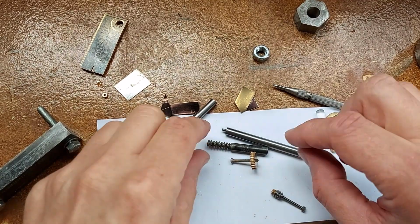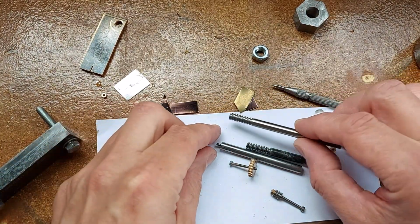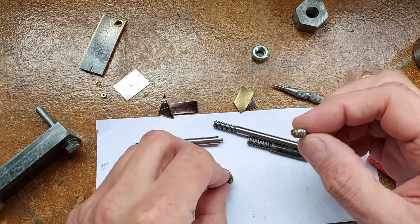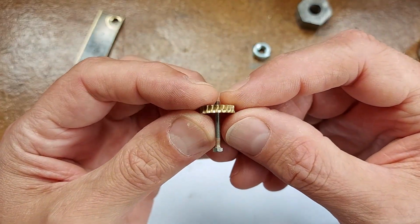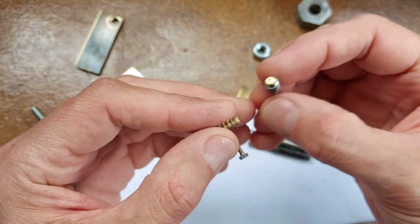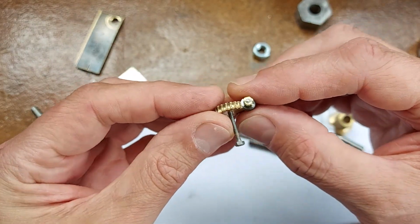So now, after making the hobbing tool, hardening the hobbing tool, some practice parts, making a mandrel to hold the gear, I've finally made the gear, and then as you saw, I've hobbed it, so it starts to fit the form of the worm rather well. And then I made a short piece of the worm in mild steel here, and then you can see that they fit together